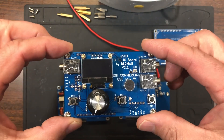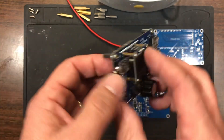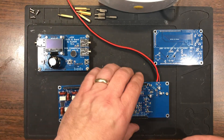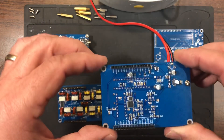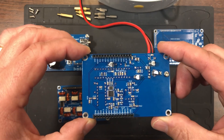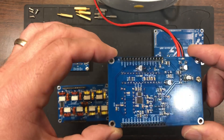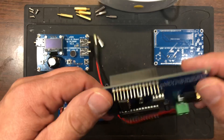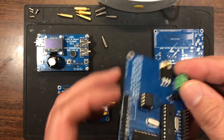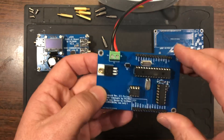As you can see, a lot of the components are SMD with a few through-hole components, but for the most part it was relatively easy to assemble. I just took my time — I didn't use any hot air rework station or anything. I just used a fine tip iron and went along and assembled everything. One difference I made compared to some of the other builders is that I made it so I could replace all the ICs, because this is a development kit.